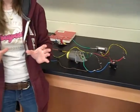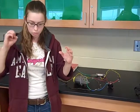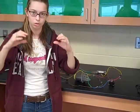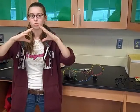Basically, the way it works is we've got a little flash lamp in there, and when the flash lamp goes off, it pumps energy into the solid crystal. It's a solid crystal laser. When it pumps the energy into the solid crystal, the individual atoms, it causes all the electrons to rise to a higher energy level. And when this happens and they go back down, they give off photons.